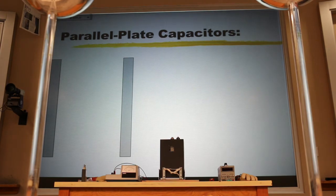Now this particular capacitor is broken. Someone brought it up to a much higher voltage than it wanted to be. And you can see that the paper that's supposed to separate the 2 conducting sheets is all pockmarked. That's because the charge actually sparked right through the paper.